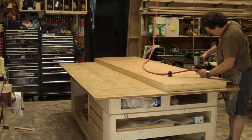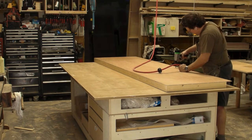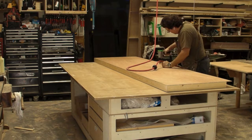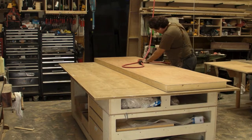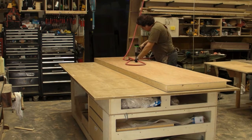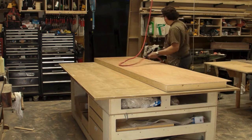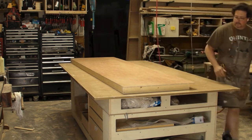I think I remember looking at this after I was done, and I felt like I was taking out stock in a nail company because I put so many staples. They're so close together. 6 inches is fine. 4 to 8 inches is typical. This is fairly thick luan, so you can probably spread it out a little more if you want. I certainly didn't take my own advice there.